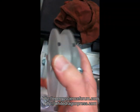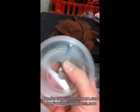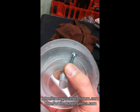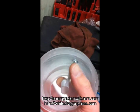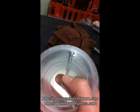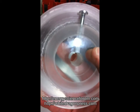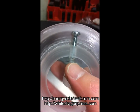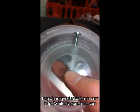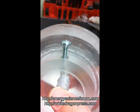I have this turned down, and with my tap — the shaft was too big to follow all the way through that thickness — so I just machined a hole that was a quarter inch thick from here to about halfway, so I could get the tap shaft to follow it and get the threads cut all the way through. You can see those threads there. That's basically for a set screw, so I can screw that in and lock it onto the shaft. I'm going to file or grind a little flat spot on the shaft to lock it into place so this doesn't spin independently of the shaft.